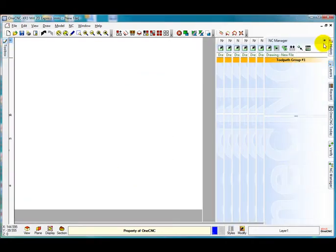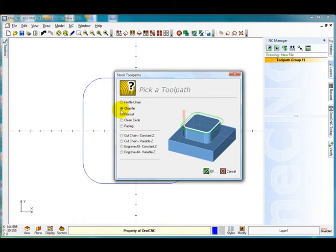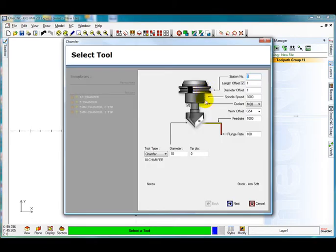So if I go into the NC manager, dock it in position, and if we go into the 2D toolpaths we are going to select chamfering. Select OK and you can see at the bottom here it says pick a position — start is active. So if I select my left mouse button where I want it, then I get the indication arrows which show cut on the inside or the outside, climb mill or conventional mill. I want to climb mill, select the end, right click, and you can see we have a 10mm chamfering tool in there. Tool 1, length offset number 1, diameter offset 1. I have got my speeds and feeds etc, select next.